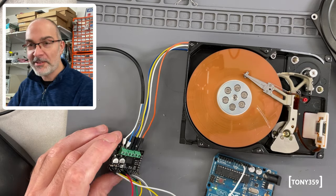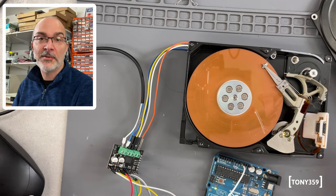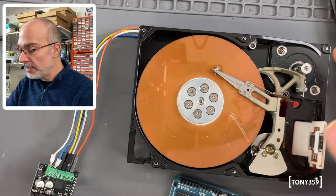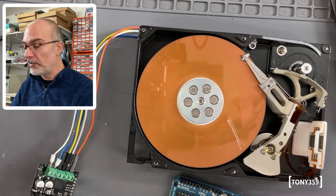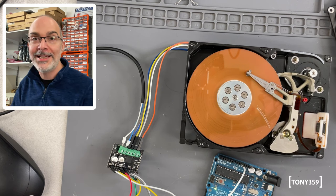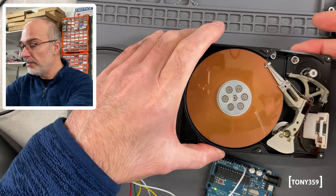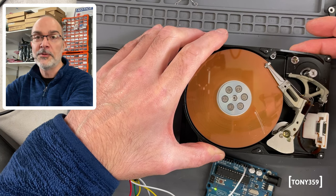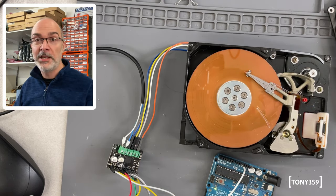Well, it's working. I think I've set the limiter so my power supply doesn't ever show anything more than 100 milliamps, which I think is more or less okay for this stepper motor. It's hard to say, but yes, I guess that could be okay. And I'm assuming, yes, I can move the stepper motor while it's idle because it's not energizing the coils. Now I've just checked on the PS2 power supply, the 12 volts line has a maximum output of 1.8 amps. So I think that 100 milliamps is going to be totally fine for the power supply. What matters is that it's fine for the stepper motor, because I've run some tests at some point without the limiter, and then I suddenly realized that the motor was literally uncomfortable to touch, because whenever it was idle, it was getting like 3-4 amps from my power supply. So obviously that's a big no-no, and we don't want that.